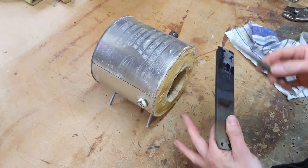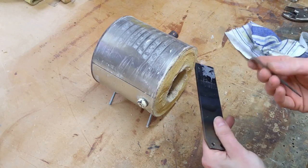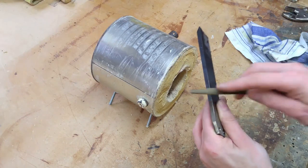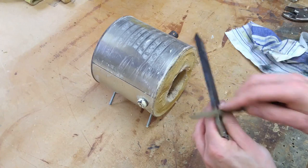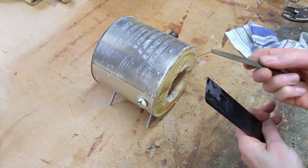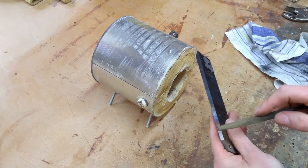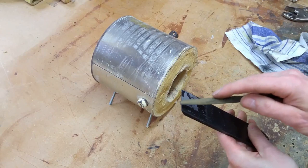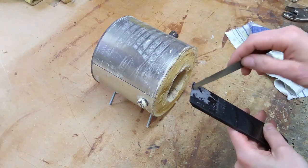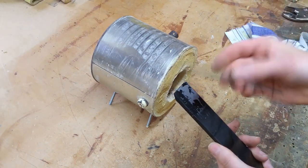And just lastly, just to check to see if you have got a hard piece of steel at the front here after the heat treating. Take an old file, best not to use your favourite file, but if you run it at the back of the blade here where the metal's still just soft, you can feel and hear that the file is cutting into the steel, whereas if you take it up to the cutting edge, the part that you heat treated, you'll notice that the file just glances over the top of the steel. And you can hear a difference in sound as well. Back here you can hear the teeth cutting the metal, and up on here where it's hardened, the teeth are just skipping over the top of the metal, which means this steel is harder than the cutting teeth on this file. So that's why you don't want to use your favourite file, because it can blunt them a bit.